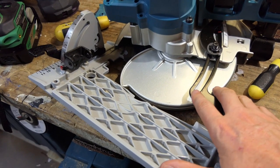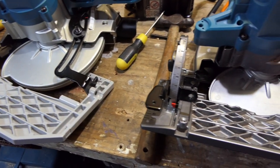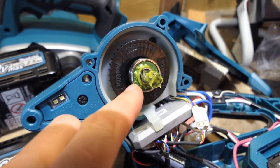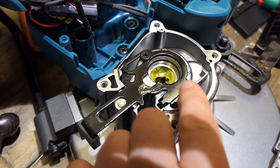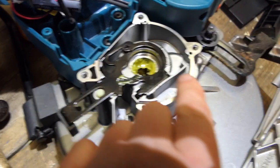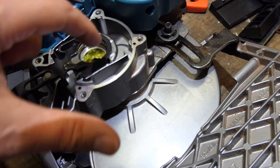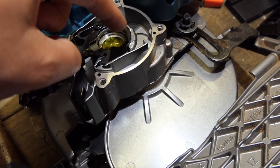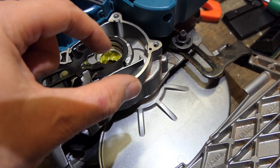These parts that look to be aluminium and have traditionally been aluminium are actually magnesium on both tools. Now, this doesn't drive directly onto your blade. If you have a look here — a little hard to see perhaps — but once it goes inside that hole, where this enlarged area is, there is a gear. So this goes in there, contacts with that gear, and that drives your blade. That gives you that extra bit of depth that we're all after.